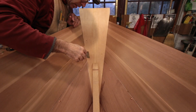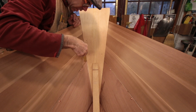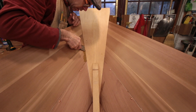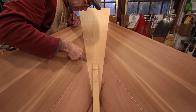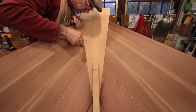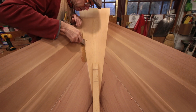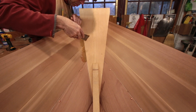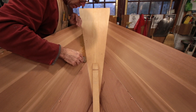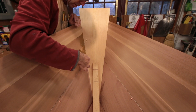What I decided to do is I'm just going to go with straight bedding compound where the solid wood planking lies here. I'm just going to carefully squeeze a little bit of this in here. I don't want it to be too heavy but I do want it to fill the joint. I want it fairly thick down right by the lap at the next plank so that it fills that little gap that is naturally there.